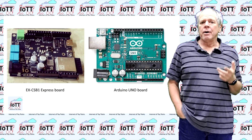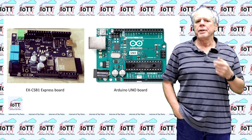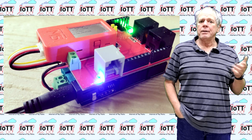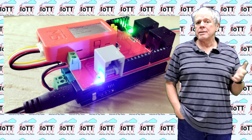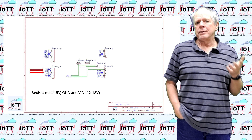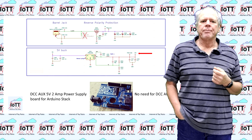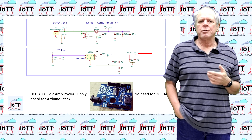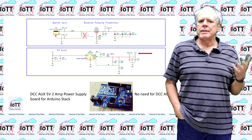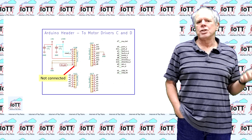The nice thing about the CSB1 board is that the designers used the same basic board layout and pin headers as we are used to from the Arduino boards. This means that existing stackable boards like the Red Hat at least geometrically fit on the CSB1 board. Of course, we have to check the schematics to make sure that the electrical connections make sense as well. The Red Hat needs 5V and ground to power the IoTT stick, and VIN with a minimum voltage of 12V to power LocoNet. The CSB1 schematics shows a buck converter for the 5V supply, which makes it possible to power the Red Hat and IoTT stick directly from the board without using a DCC AUX shield. The VIN pin, however, is not connected, so that is a modification we need to do.